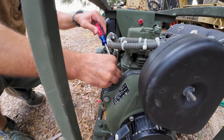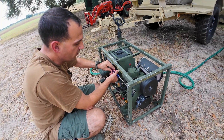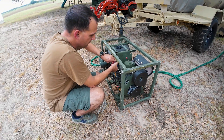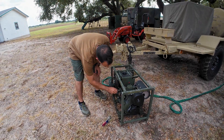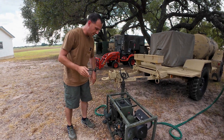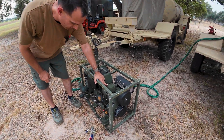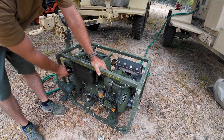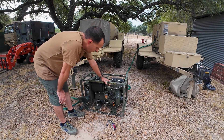Now I'm going to tighten this up, because the next thing that will throw all this off is if you have any way for air to get into this system while it's running — it'll cause the engine to stutter quite a bit. The next point in the system that you need to purge all the air out of is between the injection pump and the injector. You can crack it up top at the injector. What I found works perfectly fine: this is where the electric start comes into play. Hold the decompression lever down and do this for 30 seconds. Make sure you engage your fuel down here and just crank it over.